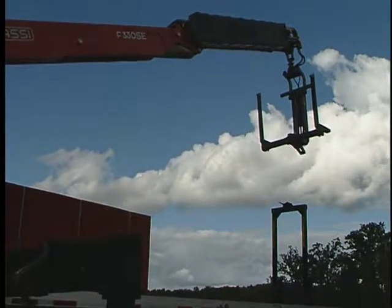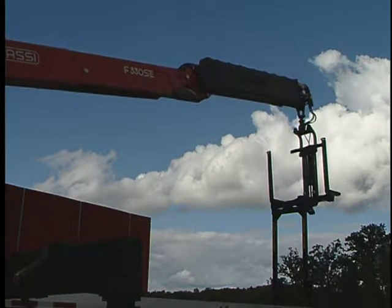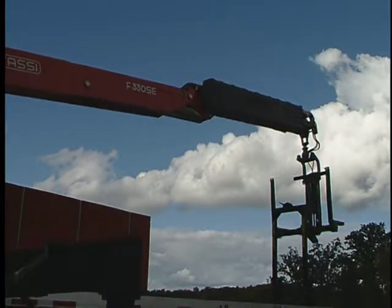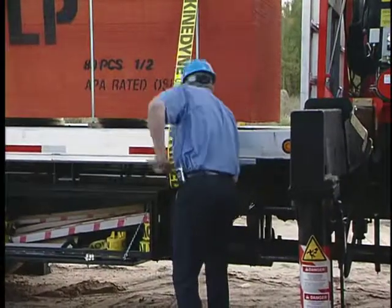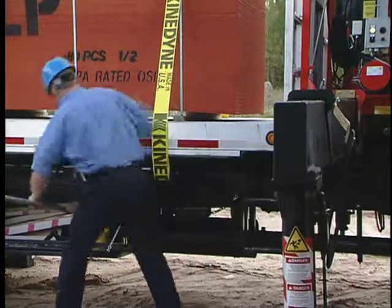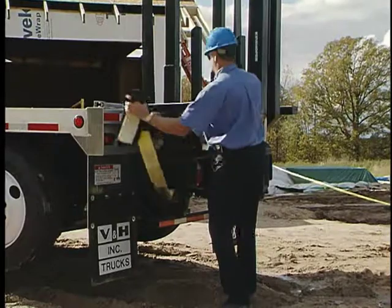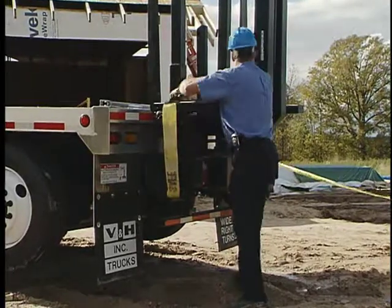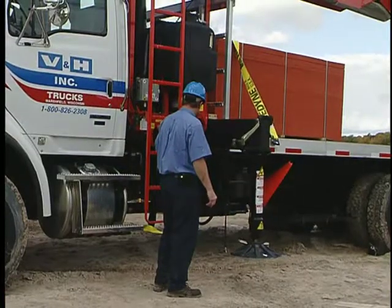Satisfied the product is properly placed and the job site clean, return the fork to its cradle, an operation we will discuss in our next video unit. Properly reload and secure all equipment, such as dollies and carts, to be sure they will not work loose during transport. Secure the fork restraining devices, strap and restraining pin. Bring in the outriggers.